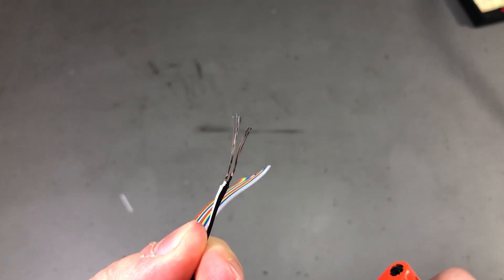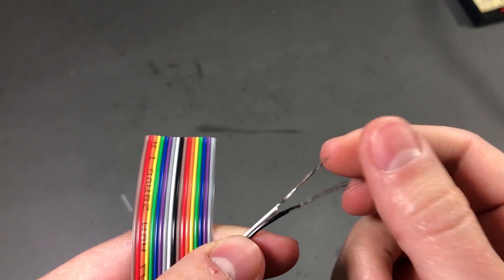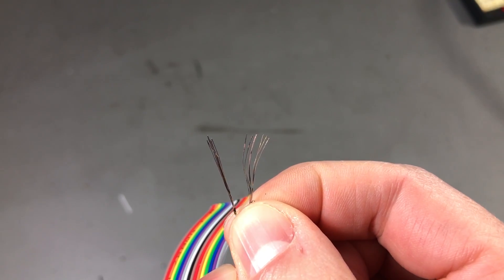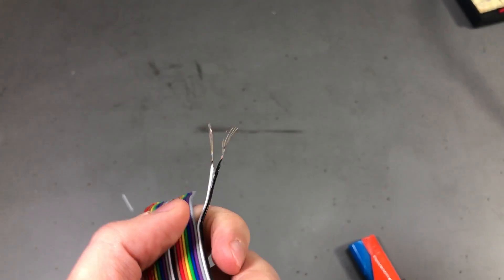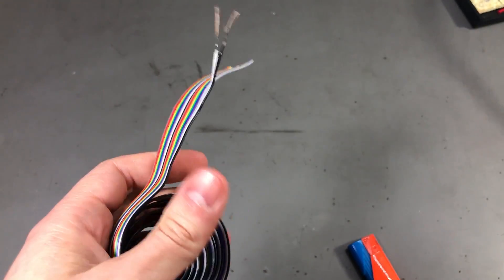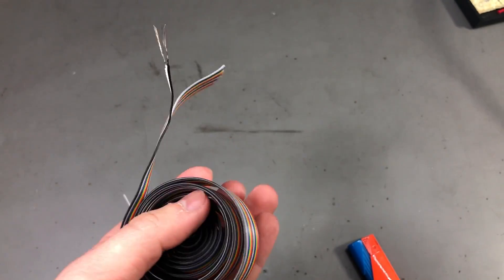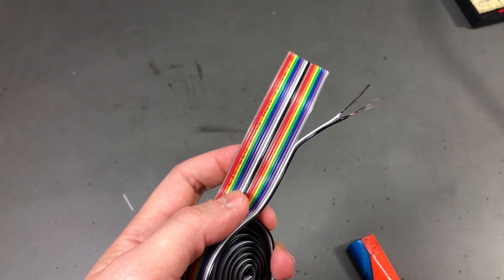It looks like it's some form of tinned copper because the wires did hold their shape and they weren't becoming soft or brittle. Now that the coating has been burned away it's also starting to show a bit of copper color. There are not a lot of strands in one of these thin wires — maybe 6 or 7 strands. Rainbow cable is something that shouldn't be missing from your electronics bench, but keep in mind these are not capable of carrying high currents; I wouldn't trust this for anything more than a couple hundred milliamps. I usually use it to connect I/O signals to an LCD panel, so we shouldn't reach those currents anyway.